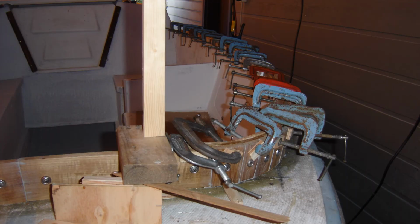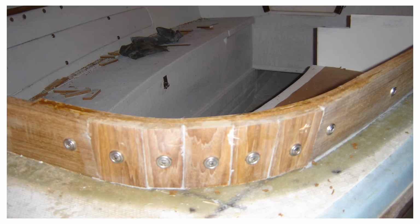This coaming was installed and attached using stainless bolts and finish washers. Everything was caulked up with 5200. There was a trim board installed around the top to dress it up and make it into a nice looking finished product. And here in this picture you can see how the coaming is starting to come together, and you can kind of see how it went together here.